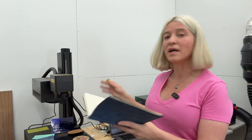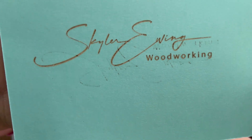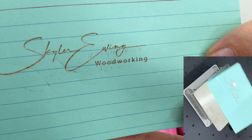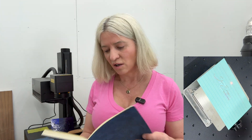Even though this is a powerful laser that can engrave metal and glass, I was also able to engrave on paper — a very clean engraving without burning the paper. I did another one on the other side of the sheet, so it shows through, but the engraving itself was really nice. For paper: speed 1000, frequency 30, Q-pulse 5, lines per inch 850.